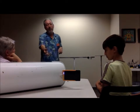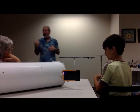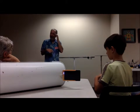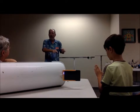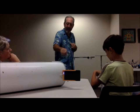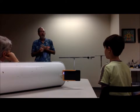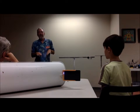And because things like the servo just suck power all the time no matter what, I installed relays so that the board just turns off the source of the power of the second board, which is the one that does the Wi-Fi and the talking. So literally that board is turned off. The power is cut off. There's no way it can suck power, and no way the servo can suck power. And the main board is shut down and only waking up once a second. And that got the power consumption down to about 5 milliamps, which was a huge difference.